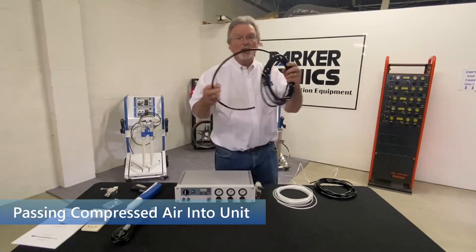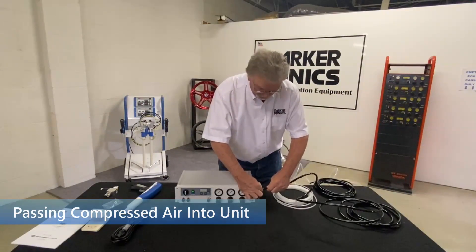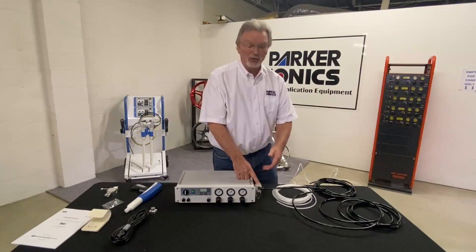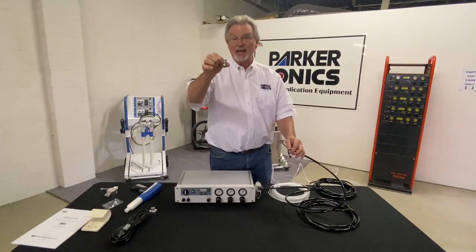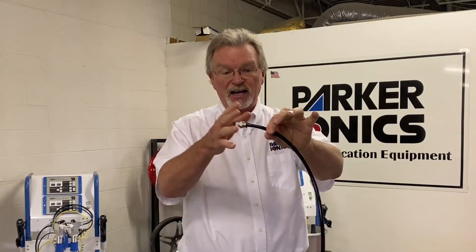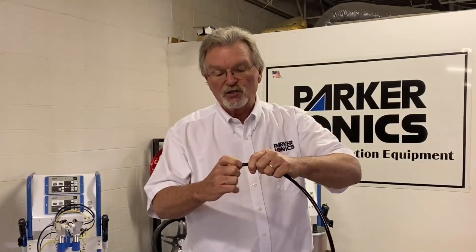How do you get compressed air to the unit? We're giving you a 10mm hose. One end of the 10mm hose connects right up here — this is a coalescing filter, so it will give you some level of protection against moisture and dirt in your compressed air. The other end of this hose connects into this one-touch fitting that comes in a bag as part of what we supply. This one-touch fitting has a 3/8-inch NPT fitting on it — screw that into your air supply source and push the other end in. Now you've got compressed air coming into your unit. To disconnect it: rather than fighting it, push the hose in just a small amount, push down, and it separates.